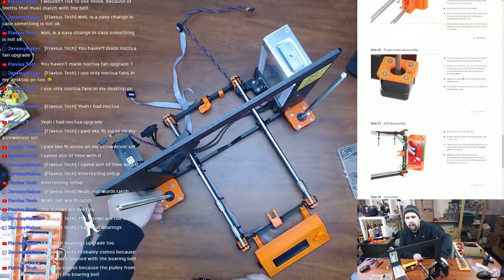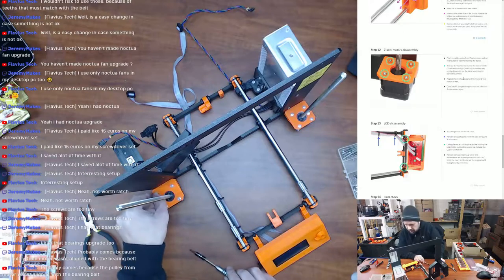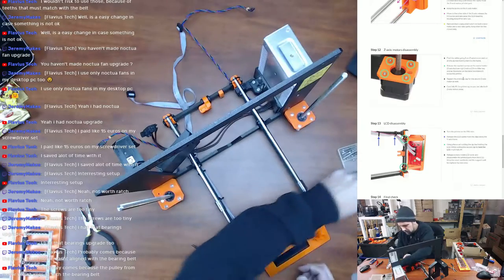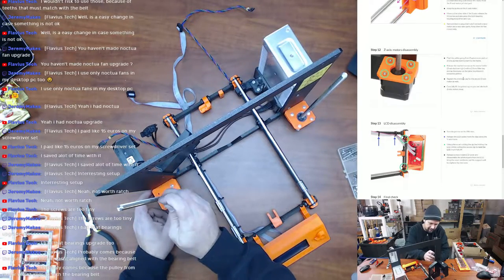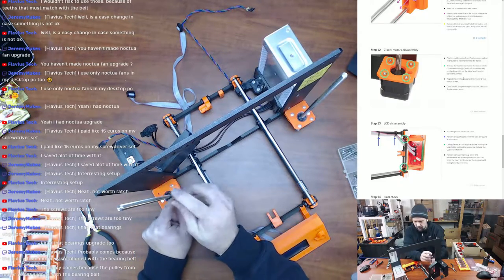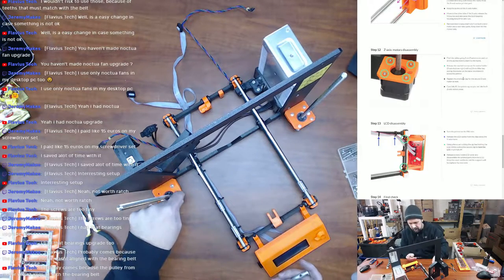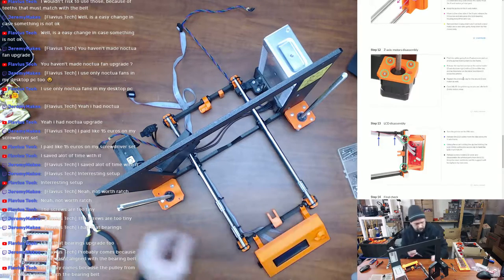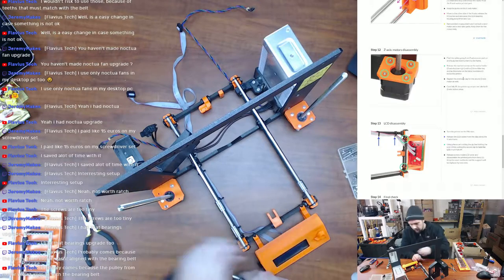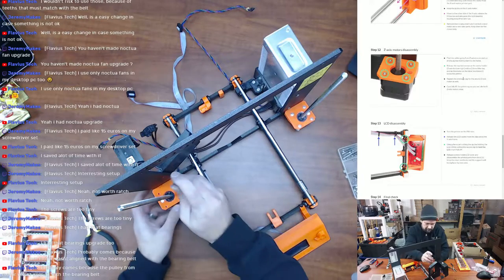That's funny. In the picture there, it doesn't show washers, but I have washers installed on all mine. I don't remember if that was part of the instructions or something that I did. I don't know why I would do that. I don't see the absolute need for washers in this spot. I mean, besides that, this plastic piece could use a little help with strength of holding the gantry, moving up and down, jostling around. Having an extra washer in there wouldn't be a bad thing, reinforcing this tight connection.